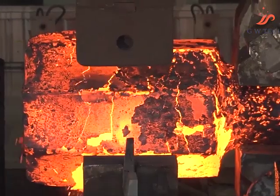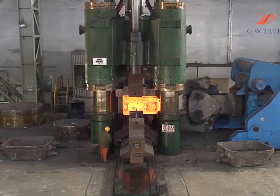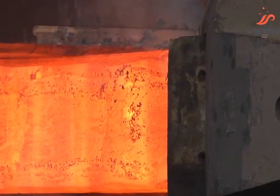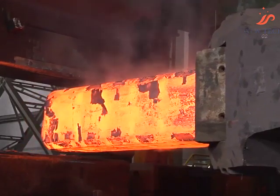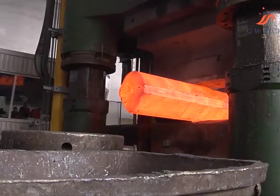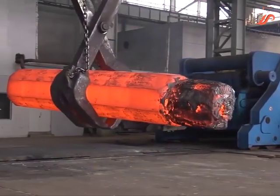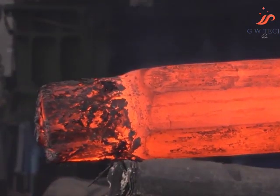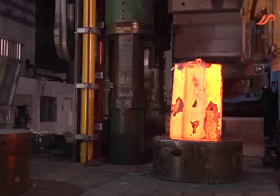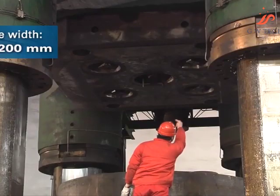The press can be used to forge tool steel, stainless steel, and alloyed structural steel to form intermediates, profiles, bushings, rings, and discs for demanding industrial applications. Press strokes and manipulator movements are harmoniously matched and program-controlled in an integrated process. The basis for high precision is the forward movement of the manipulator, the rotation and lifting of the manipulator tongs, the perfectly controlled synchronization, and the continuous monitoring of the penetration depth.